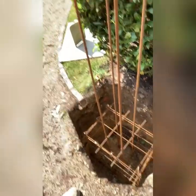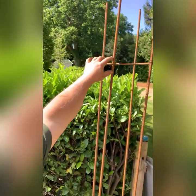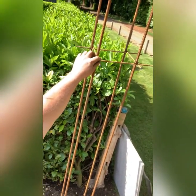Now it's a 2.5 brick pier, so it's 560 square. On top's going to have a Staffordshire blue brick on edge, but I'm not going to say too much about that. I'm going to be doing something a little bit special in the top. But yeah, we're basically cutting up the mesh and forming a box like so. So forming a lid, 4 sides and a base, tying it all together with tying wire, putting these bars in, and then I'm just keeping the bars basically separated by just another square bit of mesh.